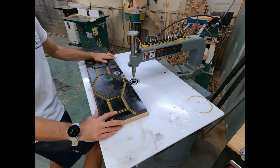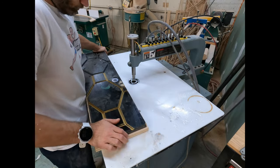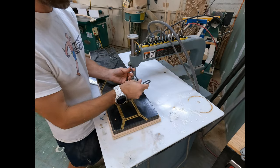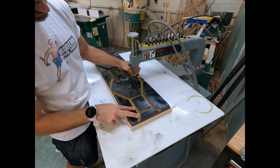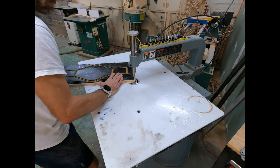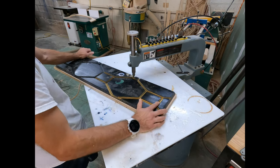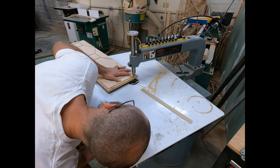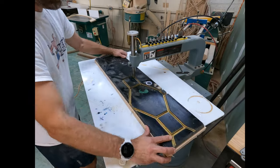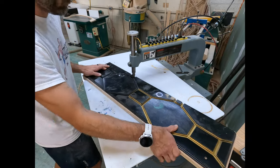Here I'm going to talk about setup while I run this part. The first thing we're going to do is double-stick tape our jig down to our substrate — in this case, three-quarter inch plywood. We have to set up how high we want that pin to be set, and then how high we want our router bit to go. I'm adjusting the pin holder so that at its lowest setting it doesn't go lower than I want, and at the highest setting it doesn't go higher than I want. It slides very well on the nylon top — it's a super easy tool.